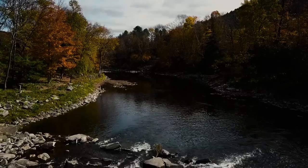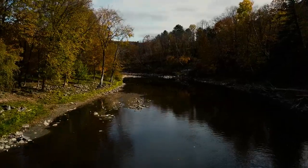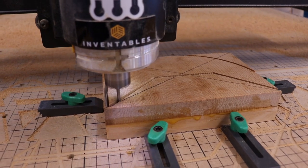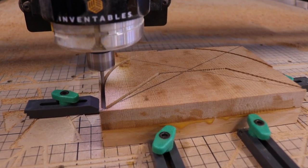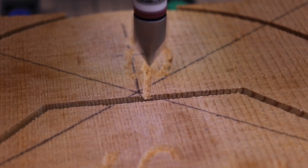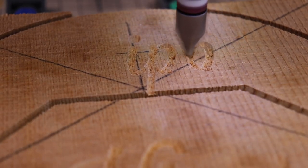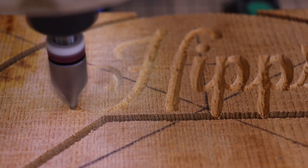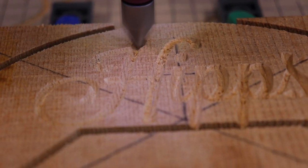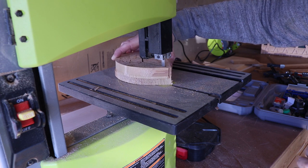The last major piece I needed to build was the lid plate, which actually bolts onto the lid of the mailbox. I used the V-bit to carve my last name in a nice cursive font. My end mill wasn't long enough to reach all the way through the stock, so I cut the remaining depth on my band saw.